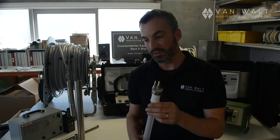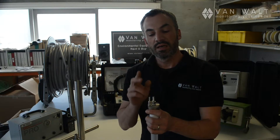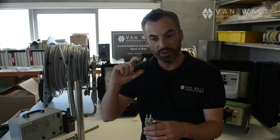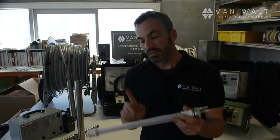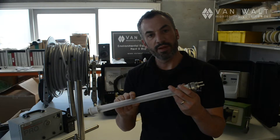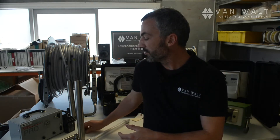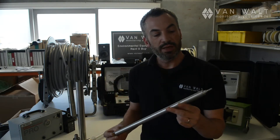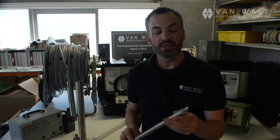But it does limit the pump. With 100 psi it limits the pump to 60 metres, regardless of the depth to groundwater, because the pump has to overcome the air pressure even if you've only got 10 metres of depth to groundwater — if the pump is down at 60 metres, you've got to push the air all the way down. The volume of this pump is about 130 ml, and you'll typically get about three cycles per minute of natural filling and compressing. There is also a 22 millimetre version with only 29 millilitres volume, again at approximately three cycles per minute depending on conditions.